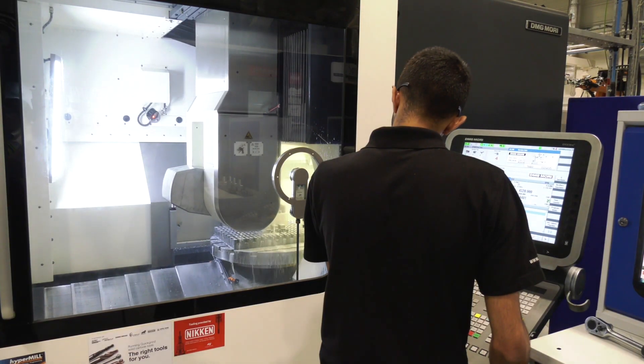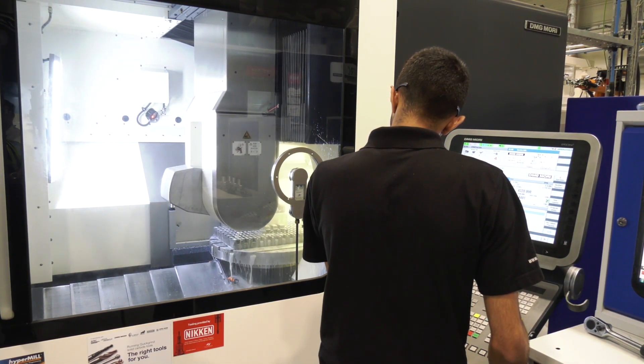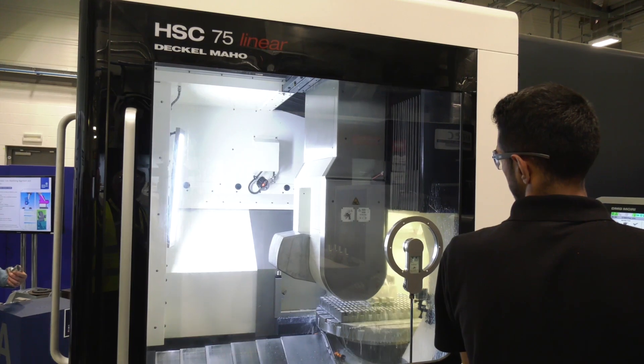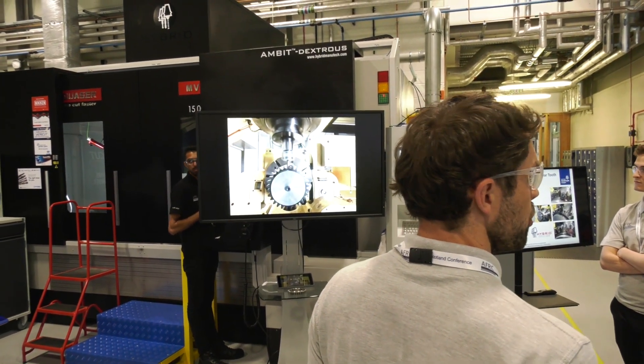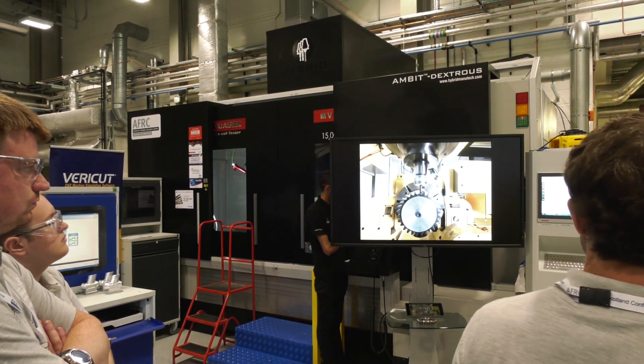Here at the AFRC we're running our lollipops and our Cayman through Hypermill software on the DMG, and that's working very well. We're also on the hybrid machine — additive machining — where they needed to take the level down and finish. We used our Spectre high-feed tool on there. The interesting part is there are basically three different hardnesses, and at the center the hardness is up to 65 Rockwell or so — it was difficult to determine which tool to use, but the high-feed worked absolutely fantastic.